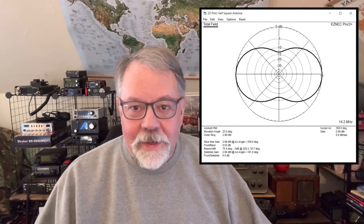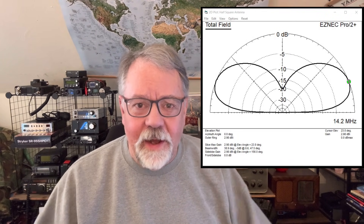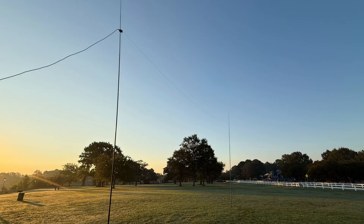I built this thing out on the beach at a park, and one of the most amazing contacts I've ever made was on the 20-meter band. I was beaming in a direction and getting solid 5-7, 5-8, even some 5-9 reports using 100 watts, talking to Australia. Then I heard a ZS call in there, and when I went back to the ZS call I was blown away — he was aiming long path around to Australia, coming to me. One of the best contacts I've ever made: two wires formed into a beam, the half-square antenna. A long-path contact from Virginia to South Africa. It's very easy to make — I've got a video on that antenna and I'll put a link below.